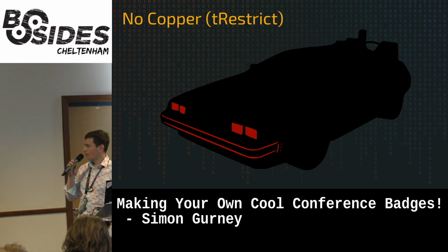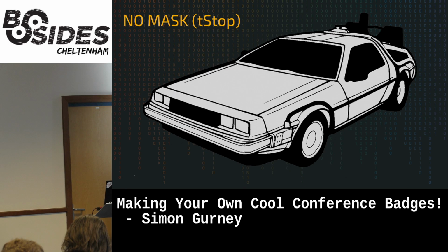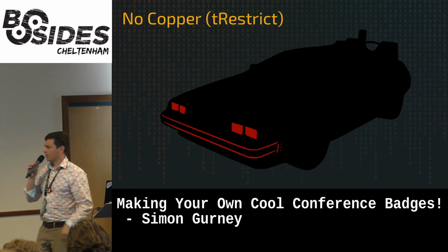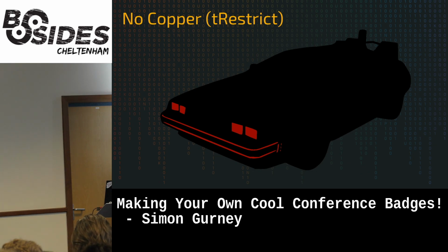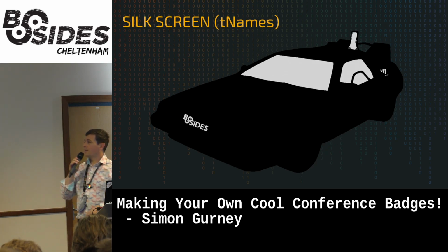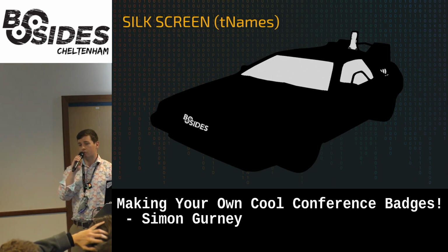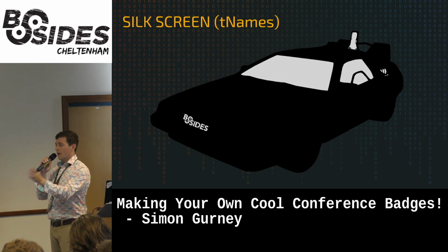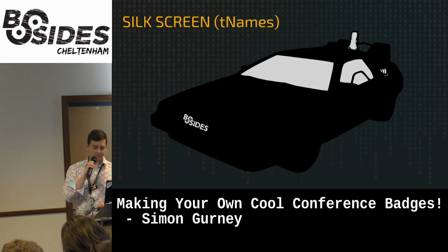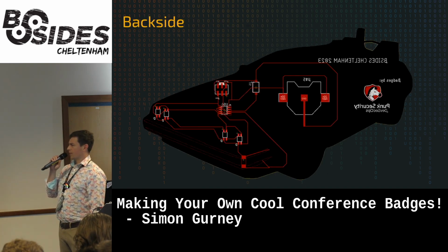And then we have the no copper layer. You'll see that the no solder mask is applying to the headlights and the rails as well. And then we have the no copper layer, which applies to the headlights and the rails. So now we've got copper everywhere apart from there, and solder mask not in those places either. And then the final bit is the silk screen, which is the white bit. This is straightforward. You just draw whatever you want and it will get printed onto the board at the end. And then the back of the board is where the complicated electrical gubbins all get hidden.